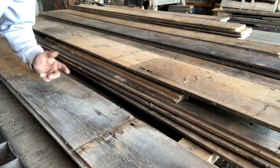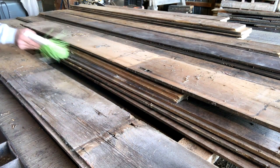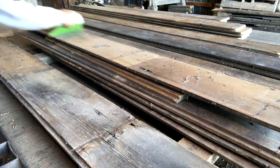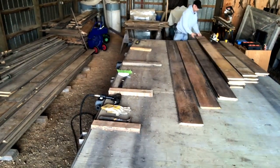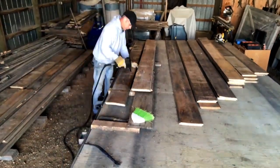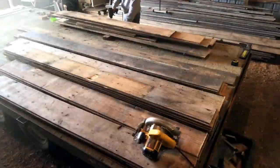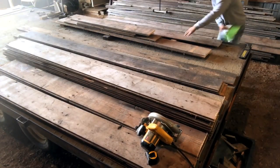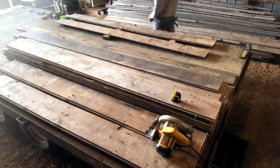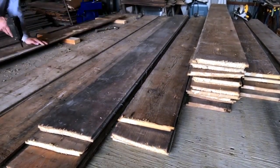I'm not looking for perfect here. When you're doing this, keep in mind you're cutting off the cracks, and every board you cut off is more dollars you're not going to be getting. No matter what, this is going to have to happen with barnwood — you're going to have to cut those cracks out. But it also goes to show you that the more careful you are taking this stuff off, the less you will have to cut off.